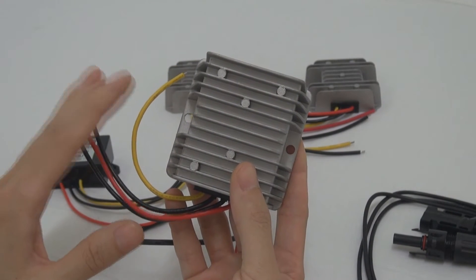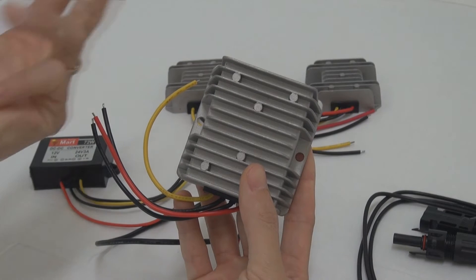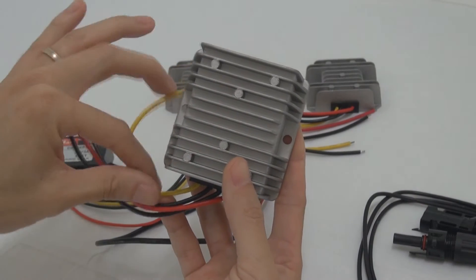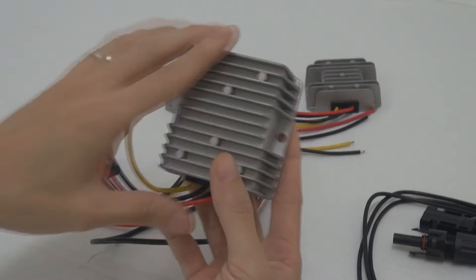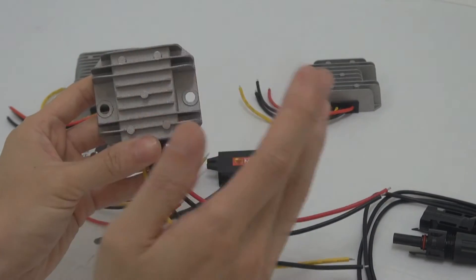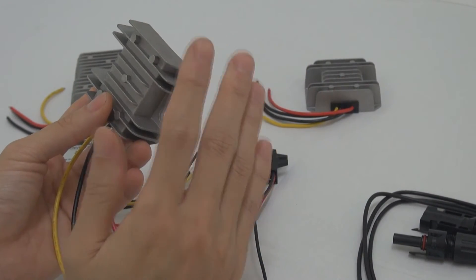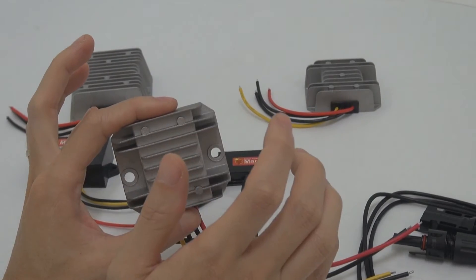The best thing to do is: let's say you have a 12V battery bank and three devices. One is 12V — that's easier, you connect directly to the charge controller. If another device is 48V, the input here from the controller or battery feeds this unit which steps up to 48V. And if the third device is 24V, we have another small one — this one is 12V to 24V. So this is what we call DC to DC inversion — it's like an inverter, but DC not AC.